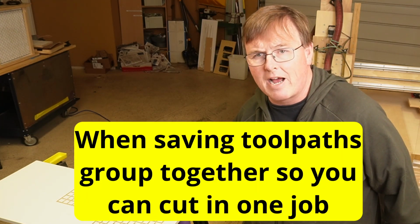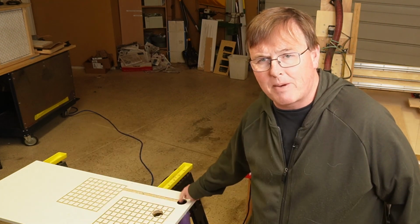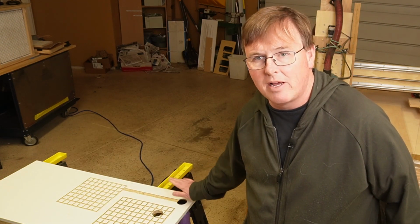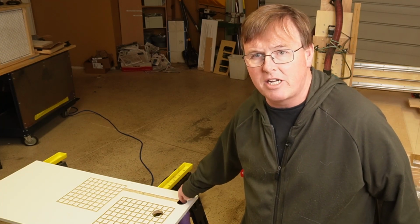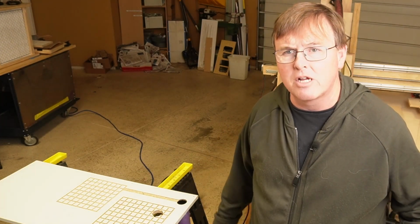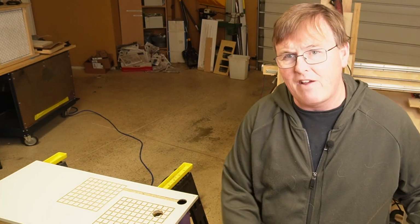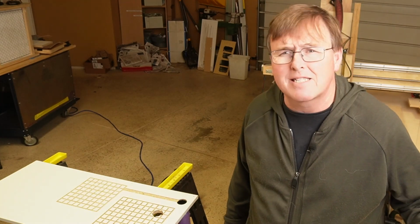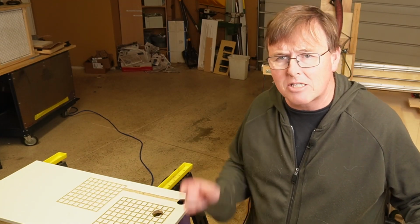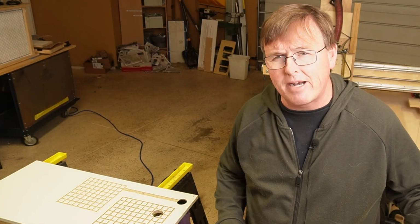When you're cutting out the hole for your fitting here, be expecting that piece to go flying out. So fix down some double stick tape on the bottom, or consider using tabs, and then you'll have to clean them up afterwards. So what is the diameter of that hole, which is a critical diameter? I found to get a tight friction fit, you need 43.75 millimeters of diameter. So do a circle in your design software, 43.75 millimeters.